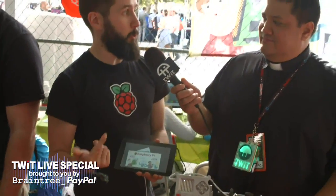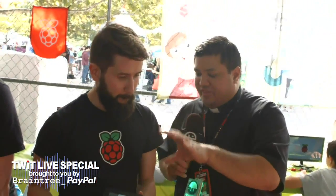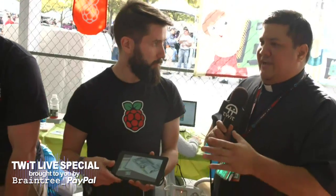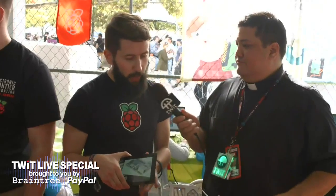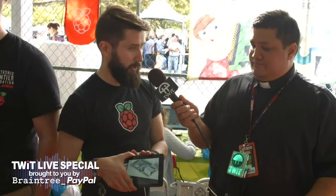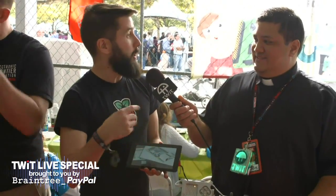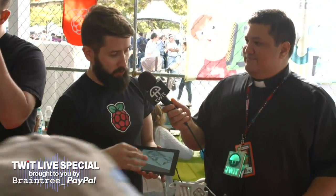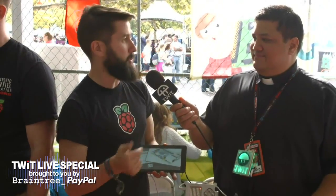This is an example we wrote with Python to show off how amazing this display is. If they wanted to start integrating with that, what kind of modules would they have to load up, or would my base package just work? So out of the box, the base package will work. You'll be able to bring up the desktop environment and log in using the screen. I recommend checking out Kivy. It's a Python library you can download to do all this on-screen drawing, to make elements and respond to touch events and gestures. It's a great library, and that's what I'm using in this demo here.